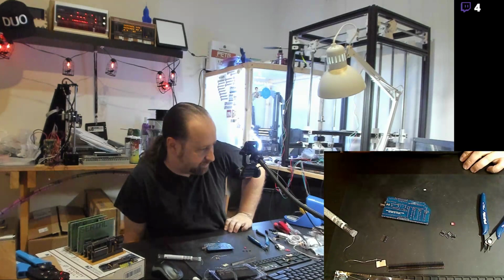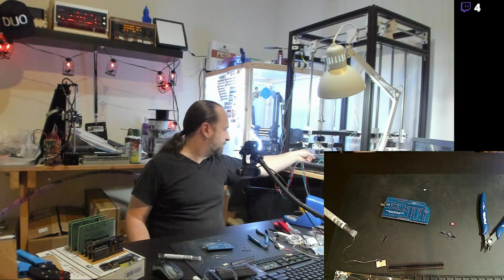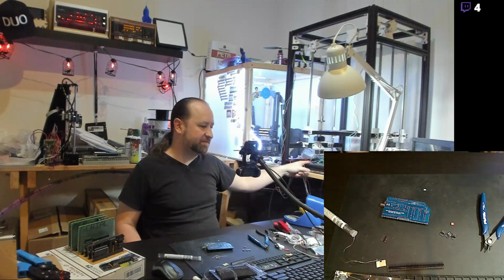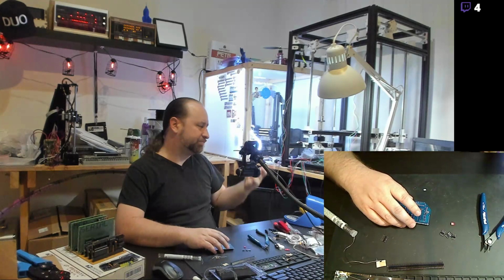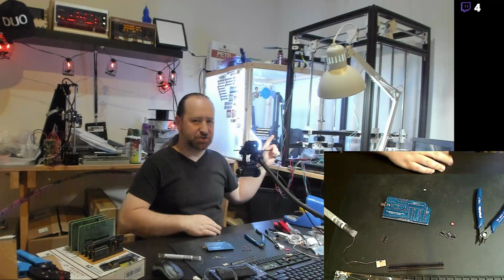super, super nice steppers. The ones lifting the Z axis, there's a dual Z on it. The stepper's back here where my finger is pointing. Those are super high torque, very strong 1.8 degree NEMA 17 motors. And thankfully, the Duet Wi-Fi board has the 2660 drivers on it that can actually crank out 2.8 amps, although it's limited to like 2.4 in software. But those motors, the Z motors, only use 2 amps max each. Actually, I don't think they do 2. Oh, yeah. No, they are 2 amp motors.